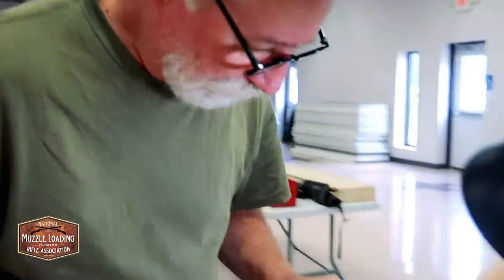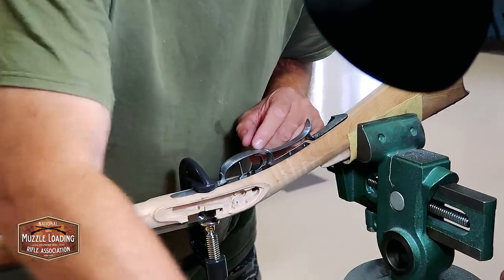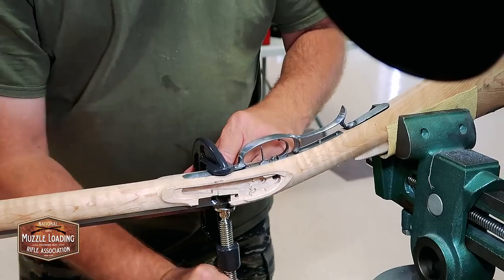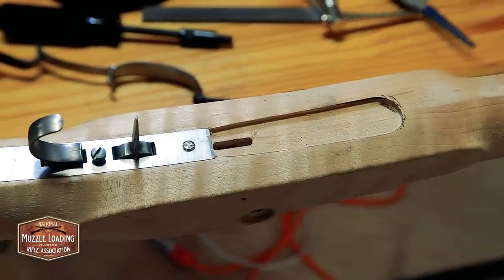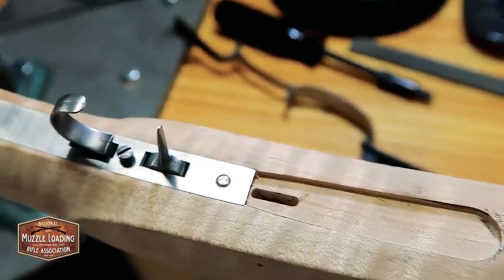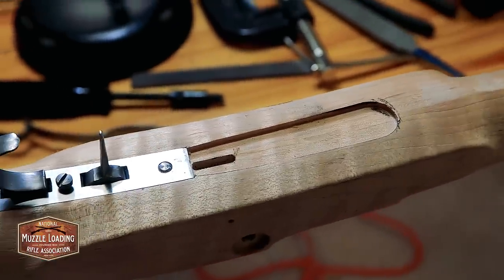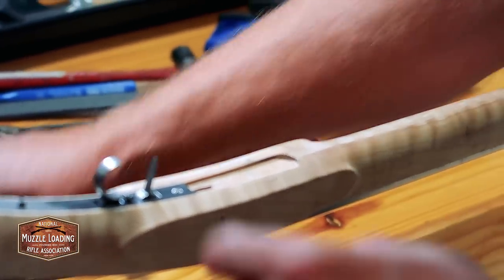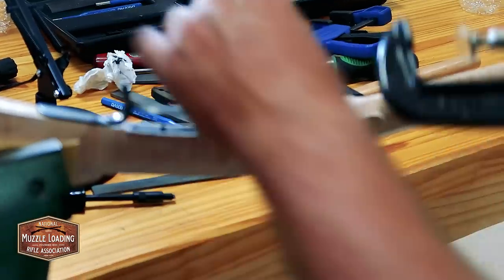Well, that looks perfect. Doesn't it? We're hitting — it may be hitting on this trigger ledge, right there. That'd be my guess. So we'll take a part and see. Or maybe the front is forcing it back — is the lug too long? Nope, didn't print down there anywhere. Let me find my chisel. I'll make a little adjustment. I think that allows the whole thing to push forward a little bit — allow it to come forward. Yeah, you see that's what I was just saying.